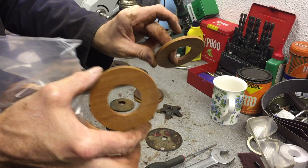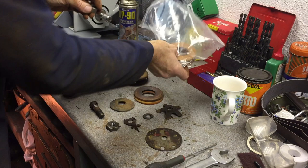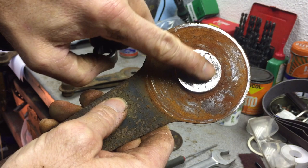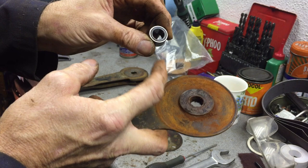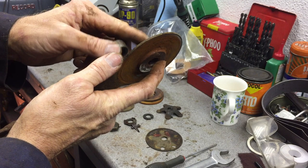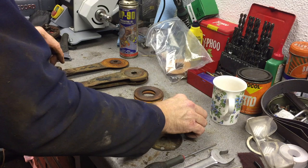For the overhaul, we have new pre-oiled friction discs — I think they're made out of beech — at about six pounds each. For each damper I've also got a new bush. The original ones are made out of wood, amazingly enough, and the new ones are made out of modern nylon. There's a bit of an issue: they're slightly undersized, so I'll pop them on the lathe and bore them out a bit. They're also slightly wider than the blade, so I'll take a skim off to bring them down to the same size as the old bush.